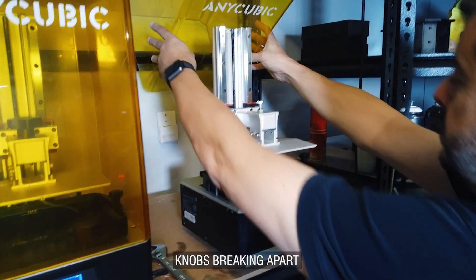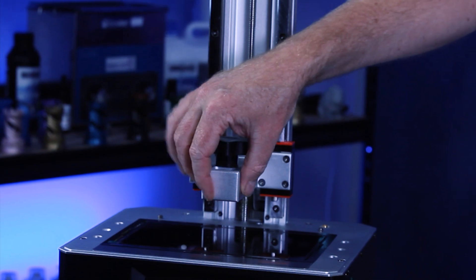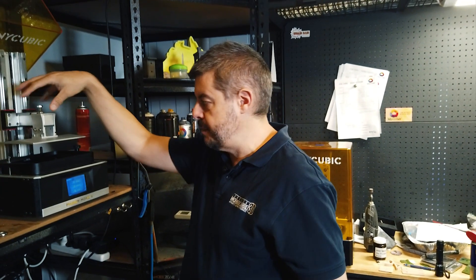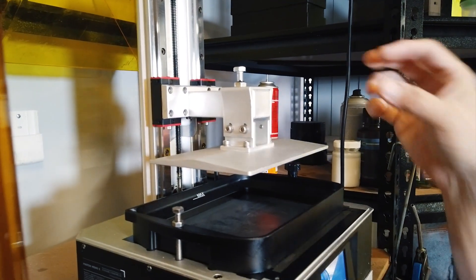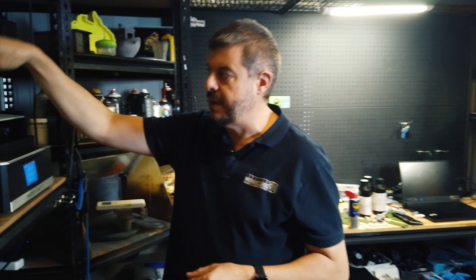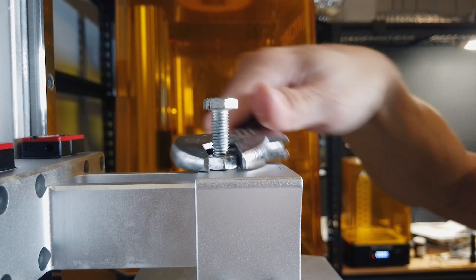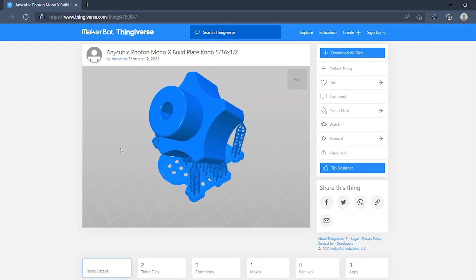This first one here — possibly the first thing you will notice is that the knobs are missing. Well, two of the knobs are missing. What we're finding with not just the Mono X but also other Anycubic printers is the plastic they use for the knobs can't handle the vapors that are trapped underneath the lid, and they start to break down and chips fall off them. You get bits of black that fall off and eventually the knob completely comes off. You can buy third-party aluminium knobs for these printers but they're not cheap, so it would be lovely if Anycubic could replace all the knobs that are failing. At some point I may end up 3D printing a replacement knob that fits over the top of that bolt.